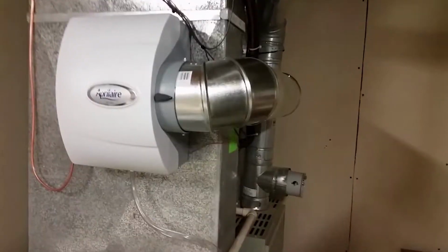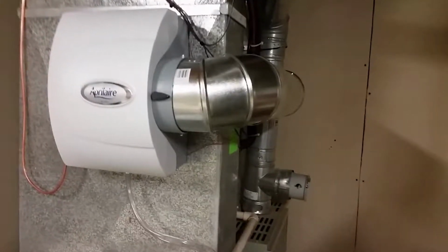Yeah, so humidifier solenoids in the fall and winter time, anybody who has a whole home humidifier is going to deal with a failed humidifier solenoid valve at one time or another. You figure you've got water running through, you've got electrical pulses on and off, any scale, anything is going to cause that solenoid to fail.